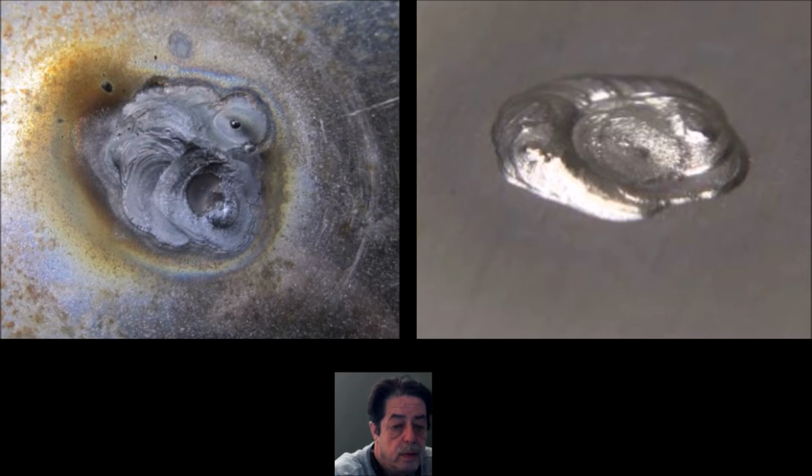Okay, the first question is saying, how much weld prep do you do? Well, if it's just to fill in holes and stuff, it doesn't matter. I could use a piece of 80 grit, 100 grit sandpaper and just scrub all around the site, and then just quickly start doing these spot welds. I don't spend a lot of time, I guess, but I do make sure the metal is fairly clean, because it's going to give you a better weld. It gives you better penetration. There's lots of pluses to spending a couple of seconds and weld prepping something like this.